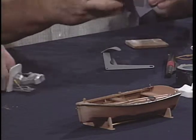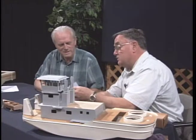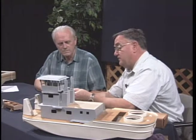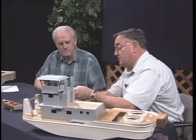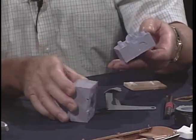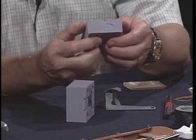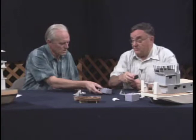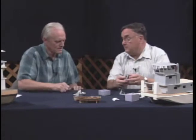What is the mold, first of all? It looks like it's rigid. It's actually a flexible rubber material — what we call an RTV material: room-temperature vulcanizing rubber. It's flexible so we can cast the part and then just flex it apart and get the part out. And these last a long time? I can usually get from 50 to 100 parts out of a mold. So I always keep the master in case something happens.